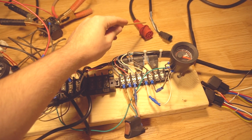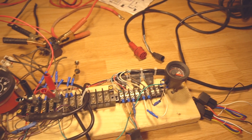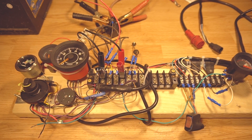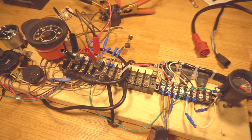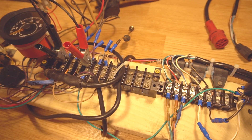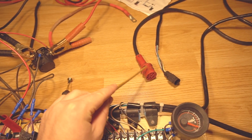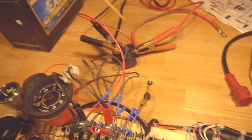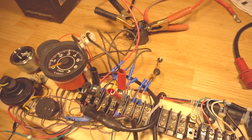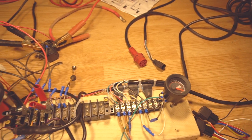Here are the Evinrude controller plugs — they plug directly into the motor and currently almost everything here is functioning: the gauges, the power, the starting, the trim, all that stuff. I also added these connector ends to each of the wires so I could hotwire anything I wanted to the controller board. Right now the Evinrude controller is not plugged in, but I do have the solenoid and the battery and everything hooked up directly to the board. This way I could test things without being near the motor, or I could plug directly into the motor and test everything that way as well.